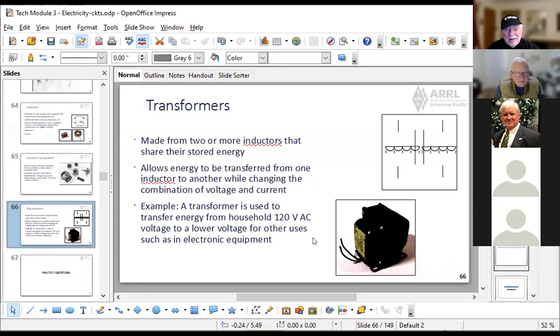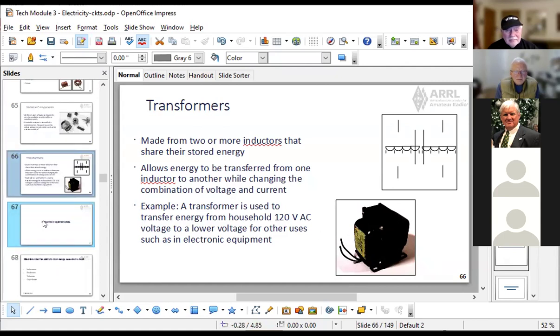There's one that you don't see that much. It's called an isolation transformer. So you don't have to worry about stepping on the ground and shocking yourself. It just isolates the ground from the wall and gives you the same voltage on the other side.